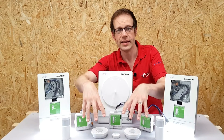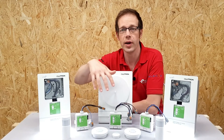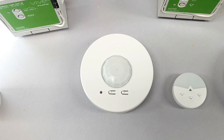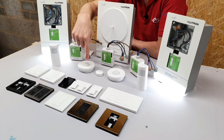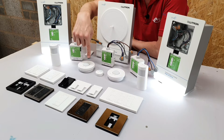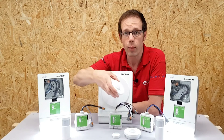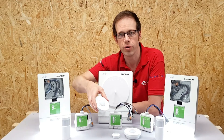The sensor pairing process is similar to the Pico: a 10-second press on the power pack, then a 10-second press on the lamp button on the sensor, and another 10-second press on the power pack to go back into operating mode. There's an extra button marked 'lamp' — pressing it once switches the connected light on, and pressing it again turns it off, allowing you to verify the pairing. A long press on the test button puts the sensor into test mode, letting you check positioning on the ceiling or wall — when it detects movement the LED indicator lights without triggering the power pack. Because the sensors come with double-sided sticky tape, you can experiment with different positions. Each power pack can have up to 10 Pico modules, 10 occupancy sensors, and one daylight sensor connected to it.